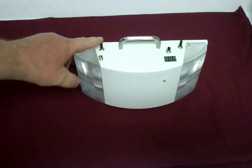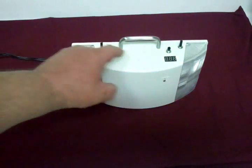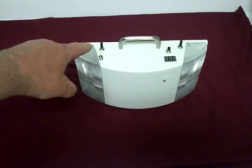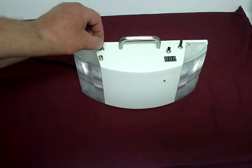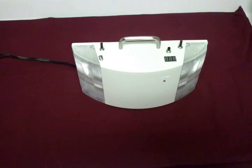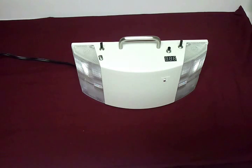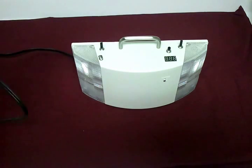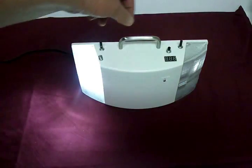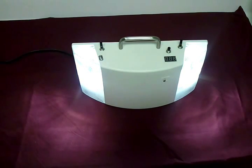On each of these lights, I put independent switches so I could control each light independently. These are DP3T switches — center position is off. Right now they're in the off position, so if I lose power, the lights will not turn on. I just unplugged it and it's not on. But if I run these toggles back, now it's running in emergency mode.